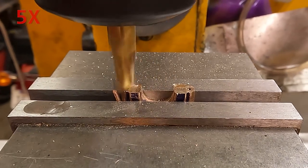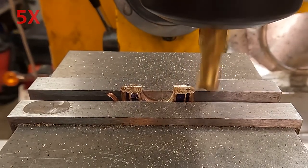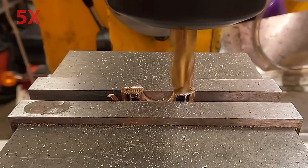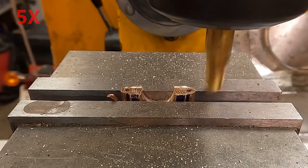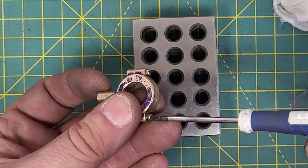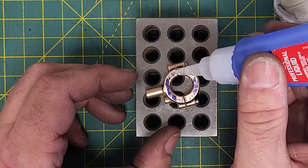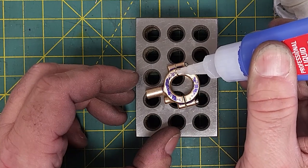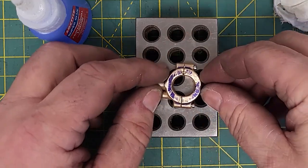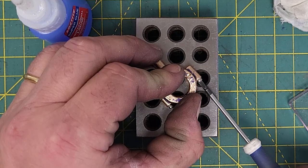Then we have this flipped around. This had the two bosses for the screws already milled, even to the same height, so I was able to use those to set this up horizontal in the vise to do this facing operation. Then it goes together - I'm leaving a little gap so I can stick some super glue in, because I know it sticks very well from a previous video. The idea being I really don't want this to move. In retrospect, probably shouldn't have done this, because it did keep the two parts slightly apart from their final distance, which leads to a lot of fettling later on.